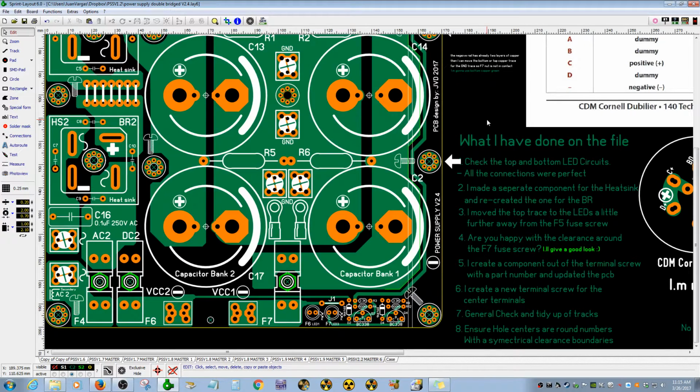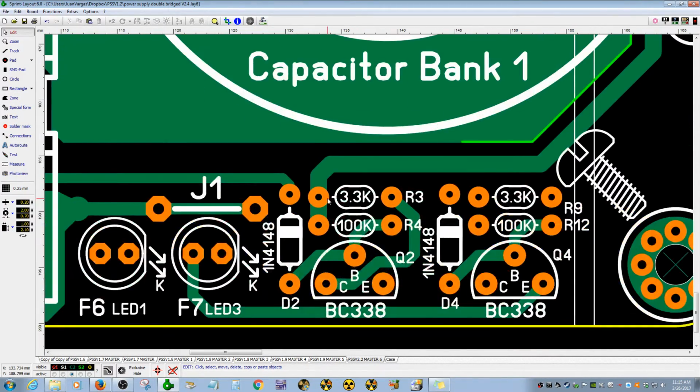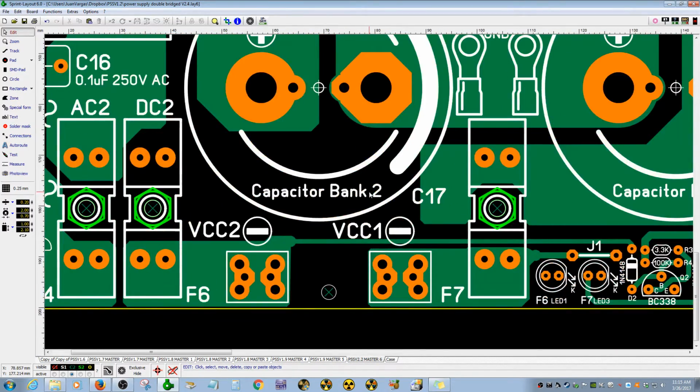All right, I already moved this trace that was here, the supply grounds, to this circuit here. So I already placed it there, and also I noticed something here that I wasn't thinking about. This PCB basically has two layers of copper, the top and bottom. So what I'm doing is trying to use that trick to have top and bottom copper, so it will complete 2 ounces of copper, so that can carry a lot of current.